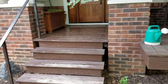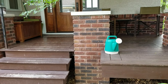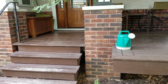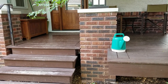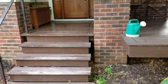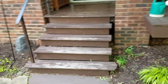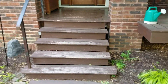We might consider bidding to fill in the spaces with brick as well to make it look nice. You can see there's brick on these pillars over here, so if we block it up we don't necessarily want to leave it as just block — we should bid to put some brick or stone on. With a four-foot-seven opening blocked to four feet, we'll have about three to four inches on each side that'll need brick or stone.